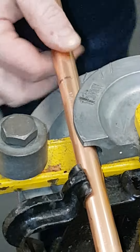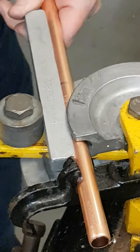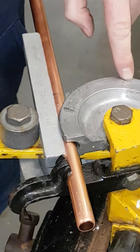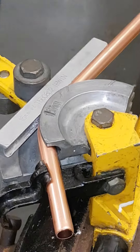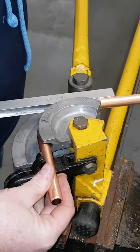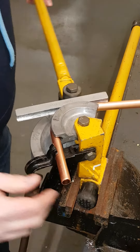Like that. Now put our guide in the back of the machine. What I want to do is make sure that it bends round so that the centre of this marker at the top here is in line with the centre of our pipe. So I'm going to pull the arm round like this, and we've now got the centre of the pipe in line with the copper itself.